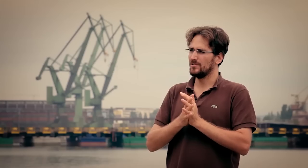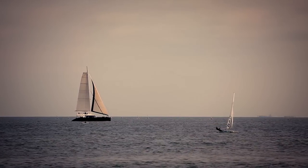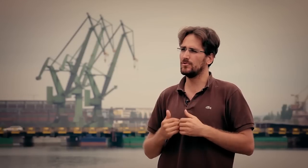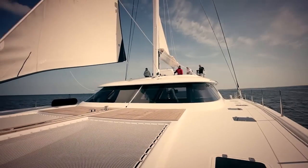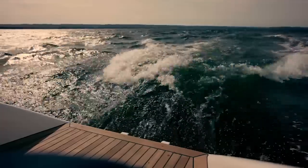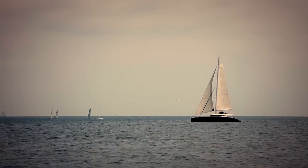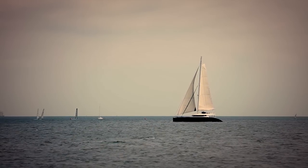Or you have a short crew of two or three people maximum, which is a great change. We have developed on the boat a system to check the load on the rig at all times. We have a very powerful rig — we put very big sails and very powerful rigs. To make sure the skipper can push the boat safely without any risk, we have 12 load pins on the boat, so the skipper is always able to know the load on the mast, on the stays, and on the winches.